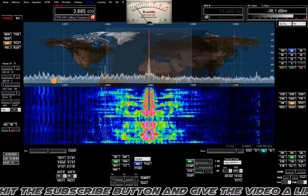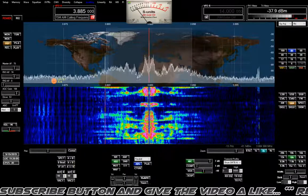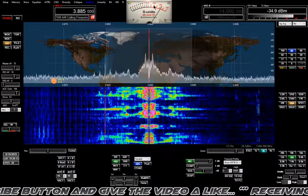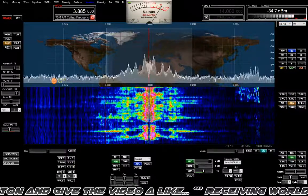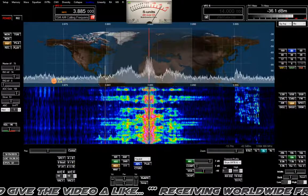Radiation resistance will be too low, so when you get a mobile stick that won't give you a low SWR no matter what you do, you'll end up having to jam a shunt capacitor or an inductor — you can do it either way — and then re-resonate the system. Then you have arrived.